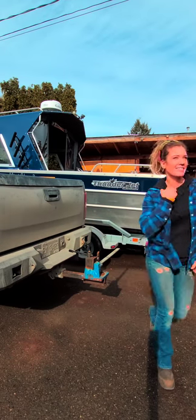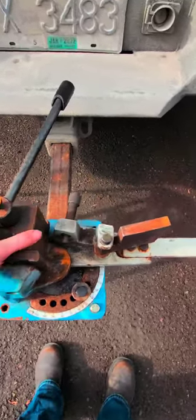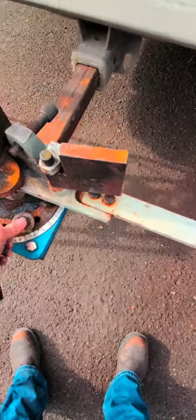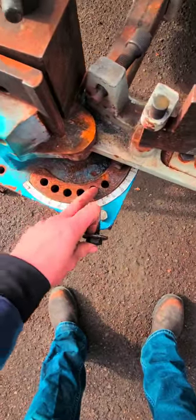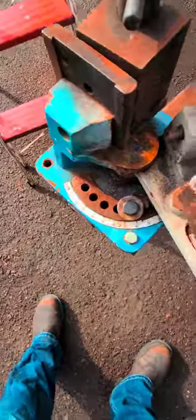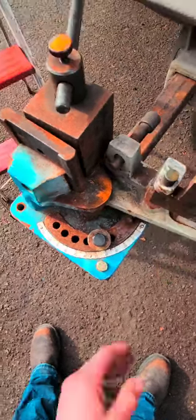Here's my little workspace, let me show you what I got. I have just a little stopper in here — I had to build it because I lost my other one. A bolt alone was too small, so I tacked a washer on here so that it only goes to that same mark every single time I bend it.